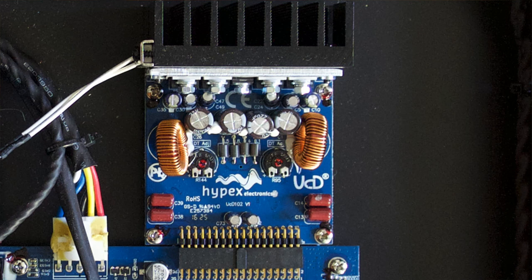This is often called a digital amp, but that's incorrect. It is an analog class D amp that works roughly like the switching power supply. Both the switching power supply and the Class D power amp are highly efficient. Whereas normal Class AB amps have an efficiency of 50 to 70%, so 30 to 50% of the power fed to the amp is converted predominantly into heat, a Class A even converts 65 to 85% into heat. Class D amps only lose about 10% to heat.